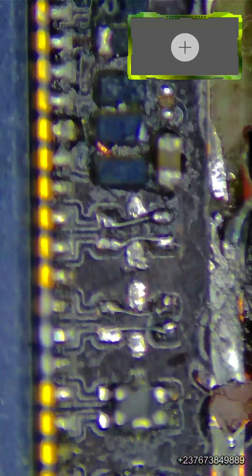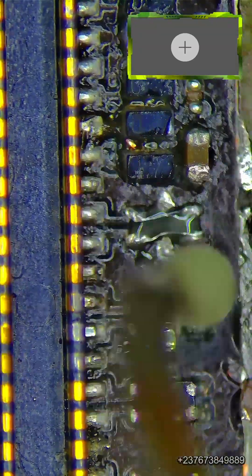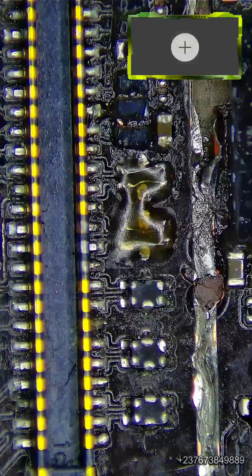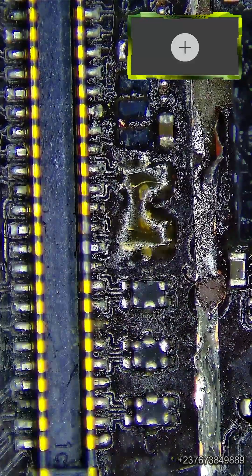Take a look carefully at how we do a jumper on the display filter. I jumper the first two — that's number three. If you take a look, you'll see those other sides at the corners — I don't link them with the cable that I'm connecting because those sides are GND. I jumper them, and if you zoom in you will see that I don't connect the other side with these cables. I use my glue, place it in the section where I did the jumper, use my UV light to cure the glue, and the jumper is done. I tested the other filters and they were reading okay.